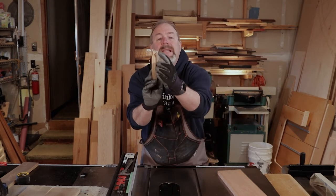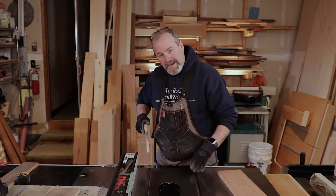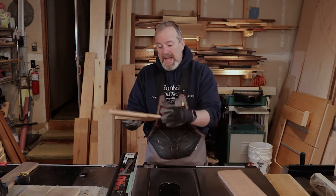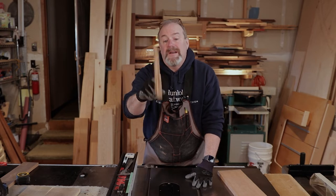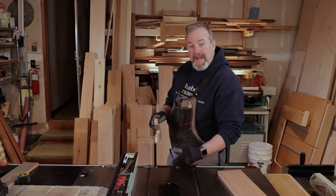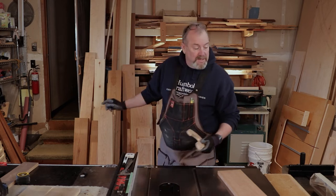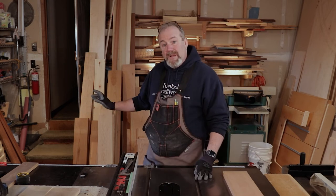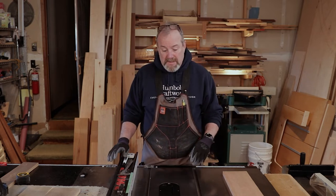I had a push stick like this. I was cutting quarter inch little dados, and I ripped one side, I flipped it over because I was in a hurry, and ripped the other side. I did it twice, and the second time, since there was nothing there on my push stick, it grabbed the saw and went all the way through into the other room, which is my office on the other side of that wall. If a piece of wood will go through a hunk of drywall, it'll go through your skin, so that's very dangerous, especially if you have little children, so be careful.